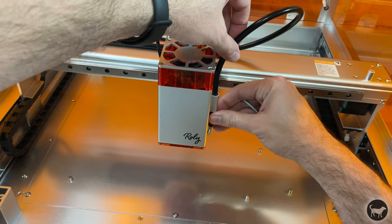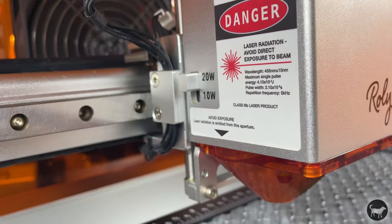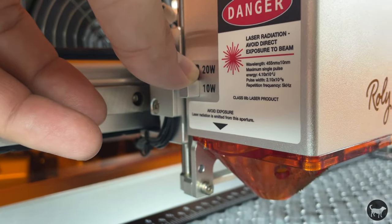The laser module has an air assist nozzle built in for easy use. The other feature of the 20- and 30-watt versions of this laser is a switch on the side to change the laser from a 20- or 30-watt down to a 10-watt laser. Essentially, you're turning off some of the laser beams in the module to improve the detail that you can achieve. A better way to explain this: you're not really working with one 20-watt or one 30-watt laser. The power is made up of multiple 5-watt diodes — a 20-watt laser is four different 5-watt beams merged into one, and the 30-watt is six beams. When you have multiple beams, it makes your spot size larger, and thus you have a less detailed point to engrave with. I like to compare it to Sharpies, where you can get a thinner line with a fine tip versus a regular marker. By turning off the extra beam, you can choose a finer point and in turn a more detailed engraving.